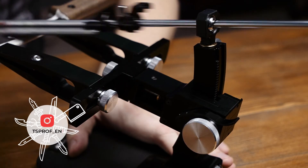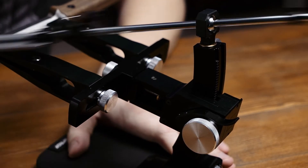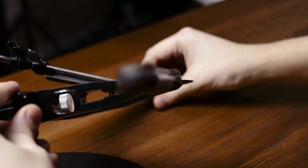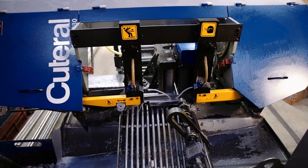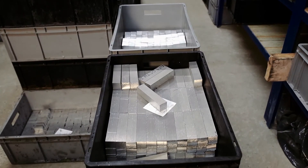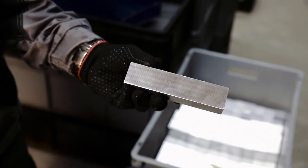What does it all give? The main purpose of the anodizing procedure is to reduce the metal's tendency to corrosion, improve the durability of the sharpener and its parts, as well as to improve the appearance of the metal product. After this kind of treatment, metal doesn't peel. The sharpener and its components serve longer, keeping their original look. The final result depends not only on the chemical compositions and observance of production processes, but also on the quality of the aluminum alloy used. In our production, we use components of high-quality 7075 T6 aircraft aluminum in accordance with ISO 9000 certification, and they come through quality control at every stage of production.